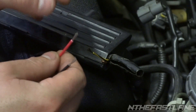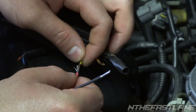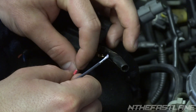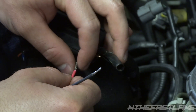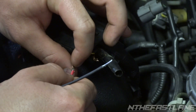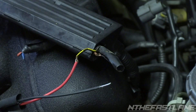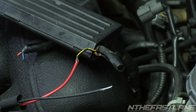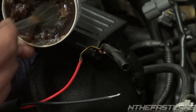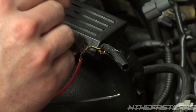I'm going to take the red wire — I'm going to leave the ends frayed rather than twisted, and insert the two wire ends into each other. This helps keep all the little strands together and lets the solder seep down in there. Once they're kind of twisted together — note that the tighter you twist, the harder it is for solder to penetrate, so don't over-tighten. Then I'm going to take a little bit of flux paste and rub it on the joint gently while the soldering iron preheats.